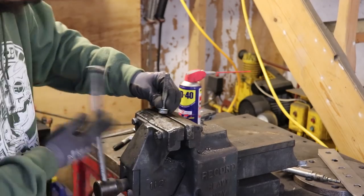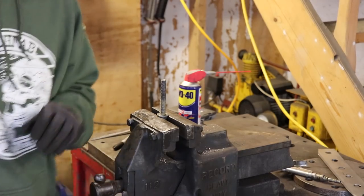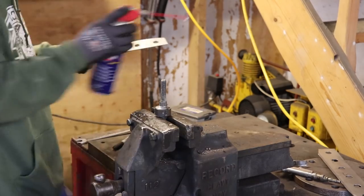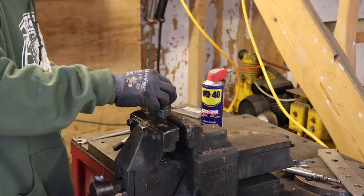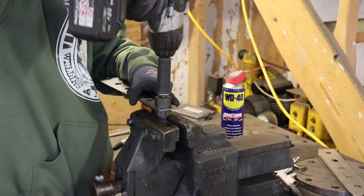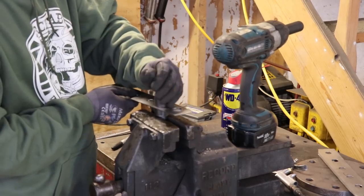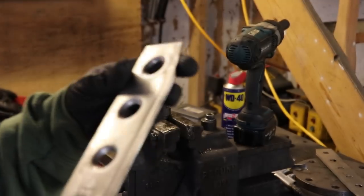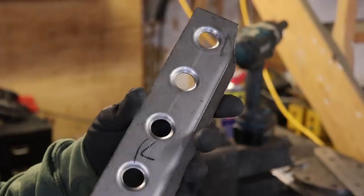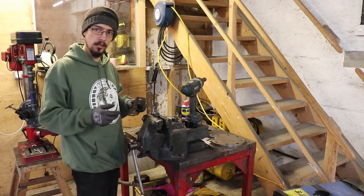Because I don't have a press, I just clamp a bolt the right size for the dimple die. And I always just lube them up a bit, just in case anything snags up a little bit — it'll work when you're tightening it. There you go. I'd say that's just as quick if not quicker than doing it in a press if you've got an impact gun. We'll do this one in real time, see how quick I can do it. Ready, go. There you go.